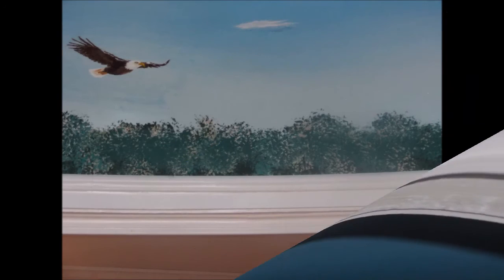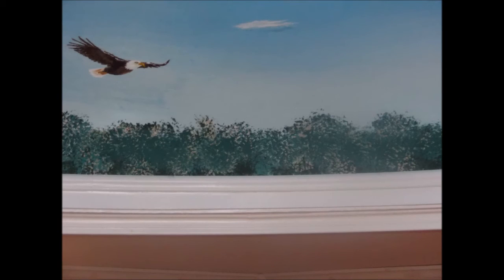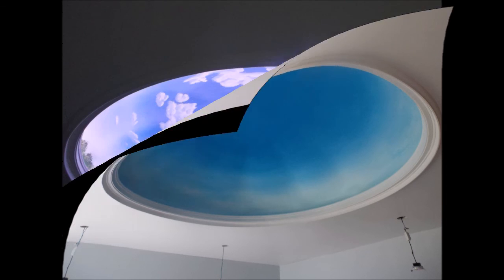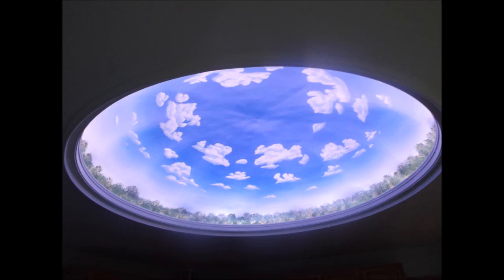Here's a picture of the interior molding showing how I stepped inward and had the upper ridge cap that hides the recessed lighting. I used LED ribbon lighting — these are only about a half inch wide, so there was plenty of room to hide all the lighting behind that ridge. Here are the individual casings glued up forming the molding, ready to be painted and finished with the lighting. Thanks for watching, my friends — bye bye!